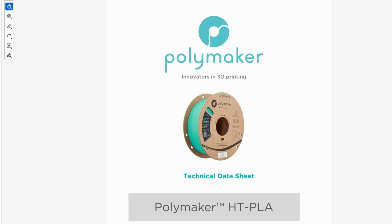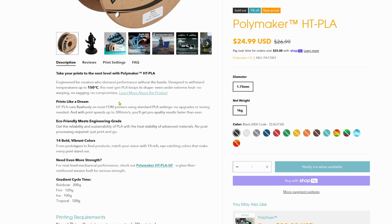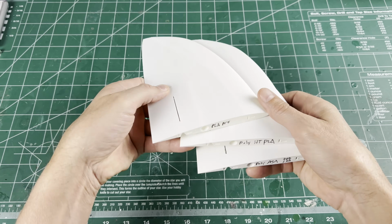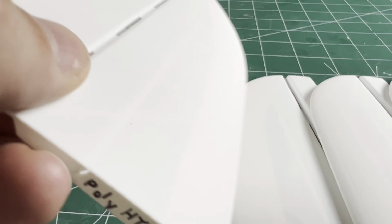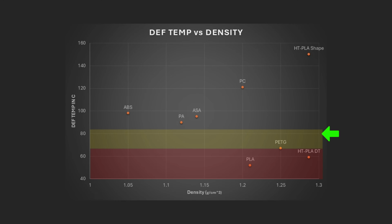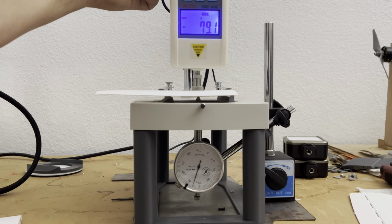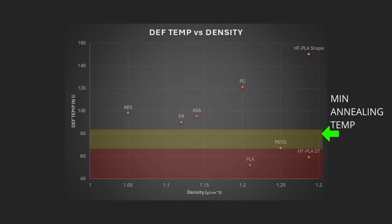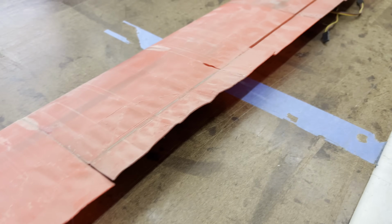So I really did want this new high temp PLA to work. Easy printing on any machine, non-toxic. Oh, it sounds fantastic. And the initial parts look really good. I could live with it being heavier and not as strong as regular PLA. A heat deflection temperature of 80 would be quite agreeable. But this is a deal breaker. Accidentally cooking your plane and making it more fragile might be worse than an obvious problem.